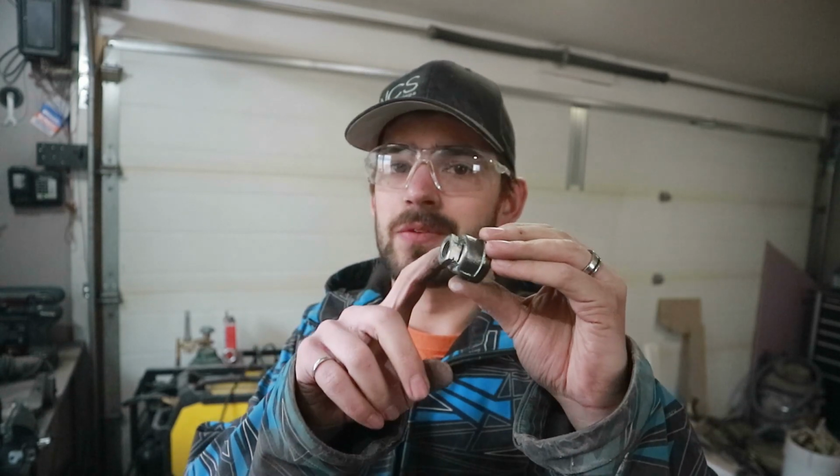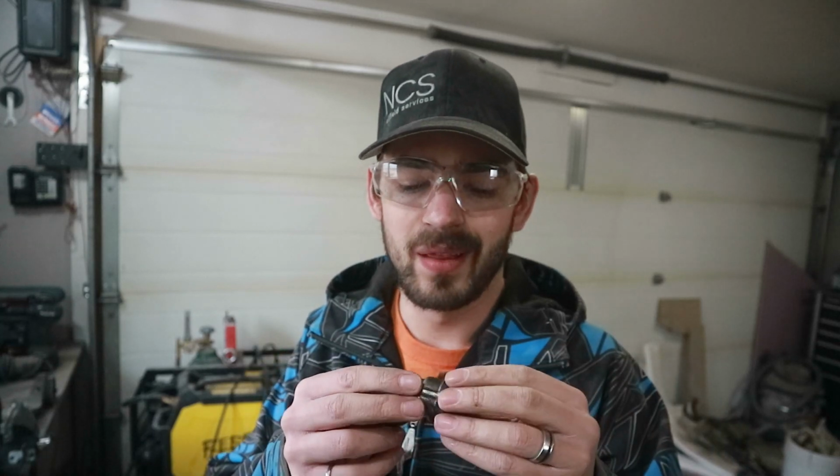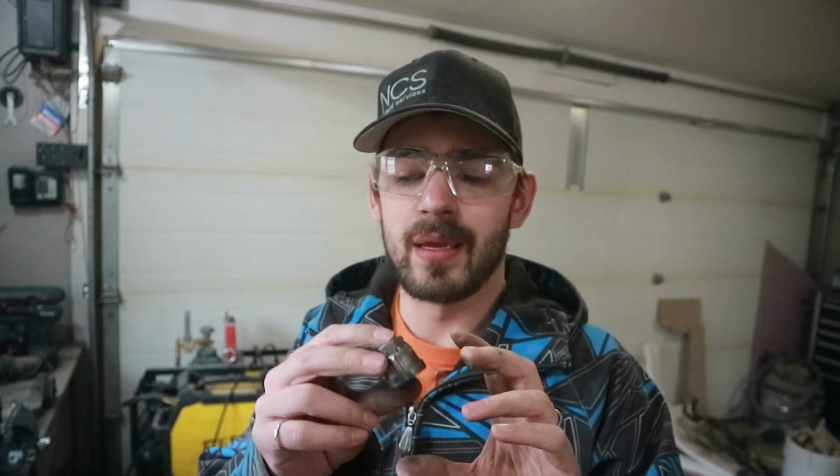Alright, that worked not bad. Drilling the hole with the lathe, I went and got the chuck out of my drill press and actually used that to get a fairly centered hole in the caps. And then just welded on the jam nut. This stuff doesn't weld very good. It's cast. Cast never welds very well, but it did work. And in reality, they're just for mock-up. They don't need to last forever, and they'll be in compression most of the time.